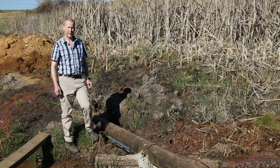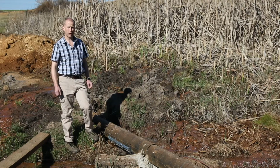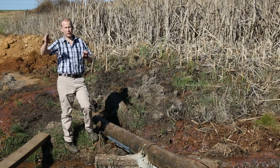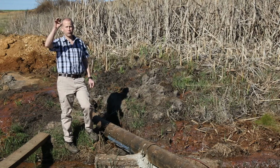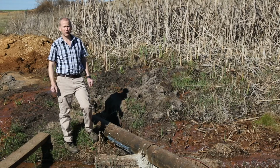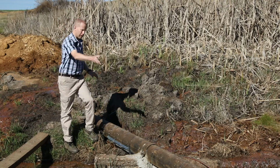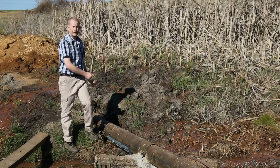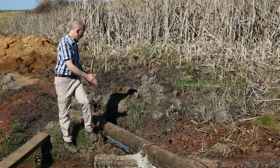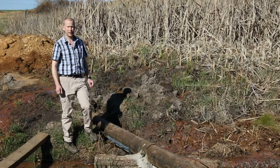You also need to select a section of pipe that will not entrap air. So a section of pipe that goes up, goes across and comes back down is not suitable to install the sensors at the top of the inverted U because of the potential to trap air in that section of pipe. This section of pipe here is ideal because it is facing slightly uphill, so any air that does come into the system will be carried through away from the sensors.